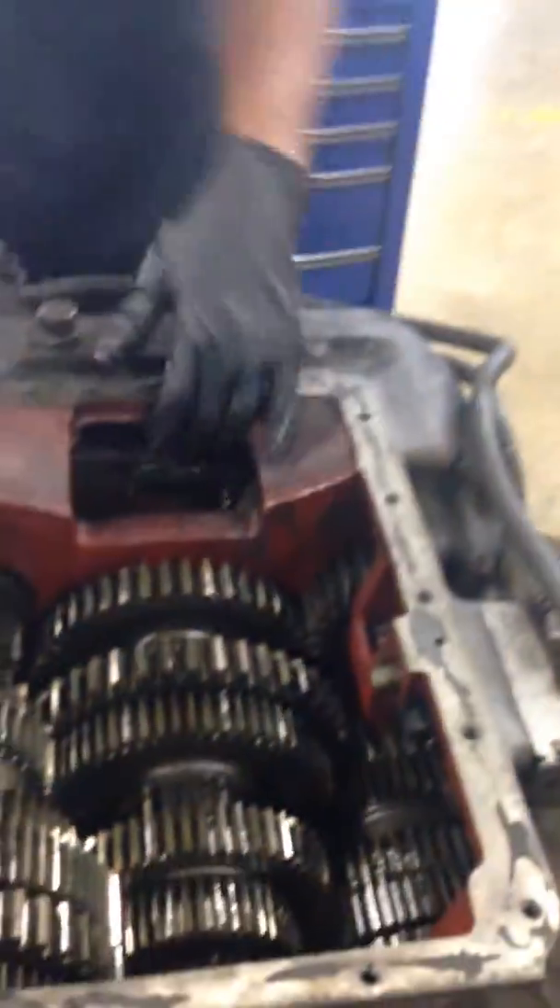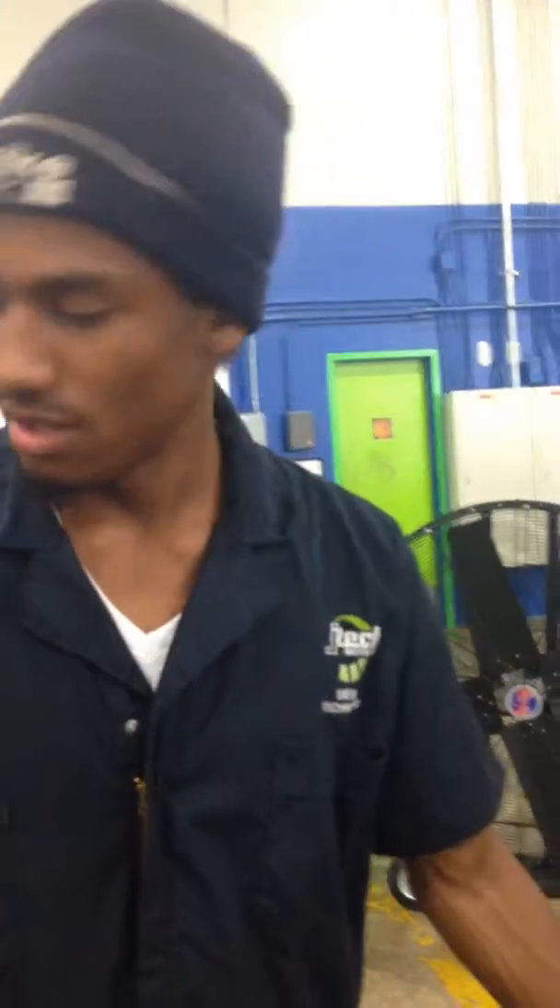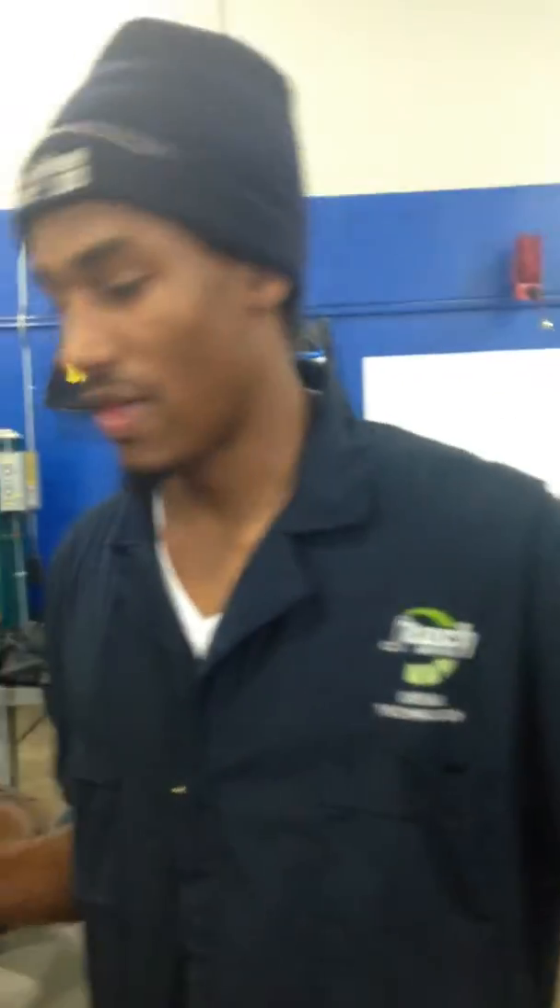When you inspect these, you would inspect to make sure none of the gears are bad. You would spin them around. As you can see, there are little chips on third and fourth gear right here, and on the counter shafts you can see they're chipped off, which most of the time is operator error — not double clutching or shifting correctly. But that is about it for the manual transmission. I'll tell you everything that I know, and this is only for training purposes. Thank you.